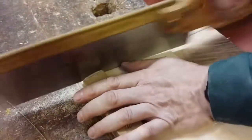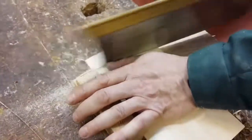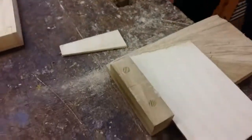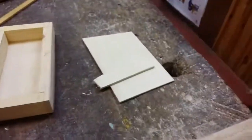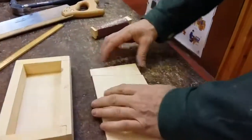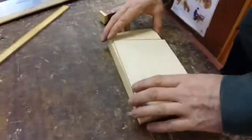I'm going to saw along that. Again finger as a guide and thumb as a guide. Use the full length of the saw when you're cutting. I've taken the two pieces over here - don't mix them up. Just clean a little bit of the edge off there and you can see the cut on the piece and my reference points.